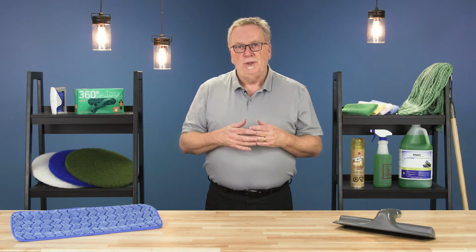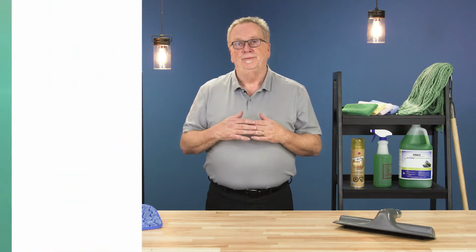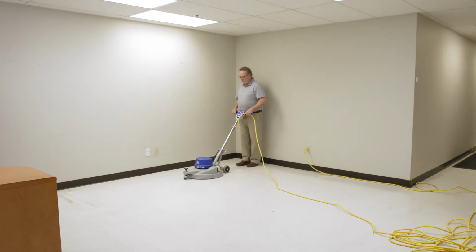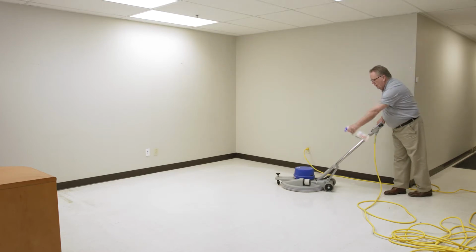In this episode, I'll show you how to properly operate and take care of a high-speed burnisher. A high-speed burnisher generally runs at 1,500 to 3,000 rotations per minute, using the heat and friction to harden floor finish and increase gloss. Burnishing is typically a dry process, but there are some chemical solutions that can work in conjunction with the burnishing pad.